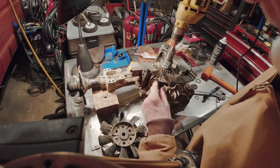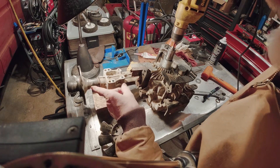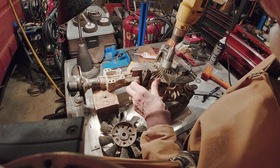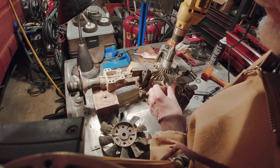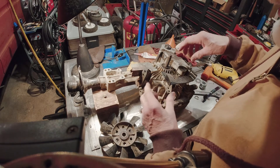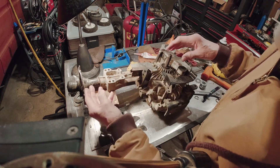This is in the — the bypass valve is open, so there's no fluid getting into the pump. So now when I close it, it'll turn. And I can reverse direction, and do this a few times. Now the first time I did this with the drill, the axle was not turning, which meant that it had to be bled. And once I did it a few times, like they say, you only need to do it a few times. It filled the pump and the motor was operating properly, so obviously the axle is turning.